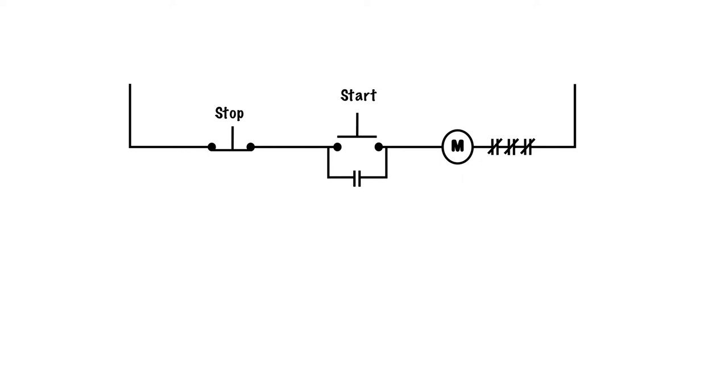Now when power is gone — say the utility goes down, a breaker trips, or for whatever reason power is taken away from this circuit — M will de-energize. When M de-energizes, the sealing contacts will open up. Keep in mind that the start button was already in the normally open position. So if power is restored to the circuit, power can come to this node but can't get across the start switch, and it can't get across the normally open contact. So in order to start the circuit, we need to press down on the start button once again, which will energize the M coil, which will pull in the normally open contacts. And again, it will seal itself in so that when we let go of the start button, it will have a parallel path to keep M energized.